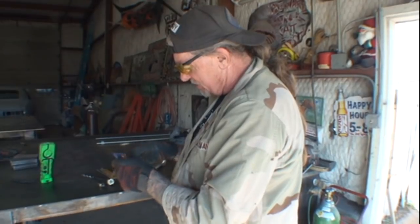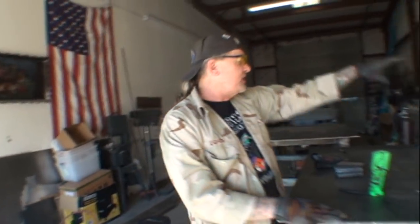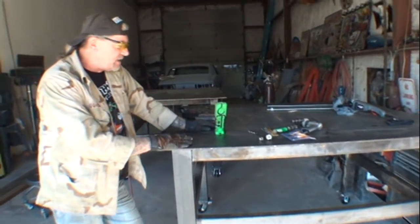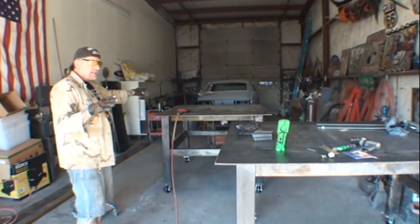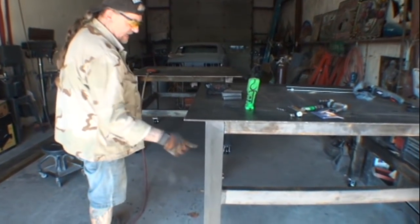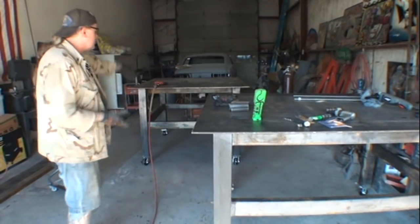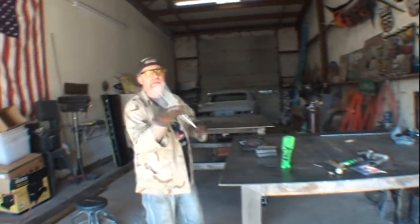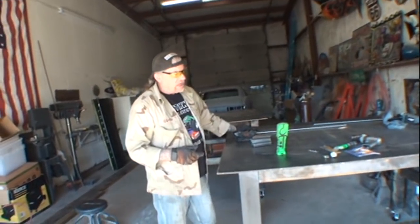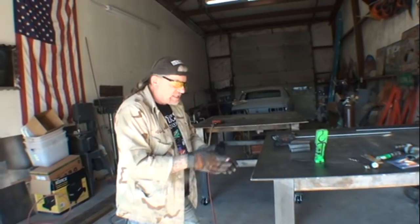It says on the package: made out of titanium carbide steel, for use with corded or cordless drills. And we're gonna go ahead and try those out. Me and Minnie just got done building some welding tables for a special project coming up — we got two of them. What I gotta do is drill into these legs. I gotta put a 5/8-plus size hole in there because we're gonna tie these two tables together using this all-thread rod. I gotta drill a hole big enough so the bolt will move around inside there and center itself up.